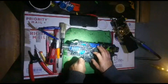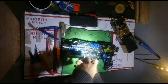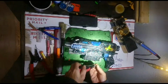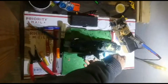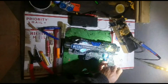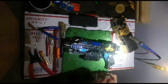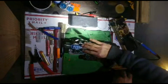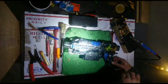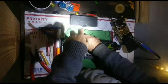So now we'll go ahead and put in all of the screws, being careful not to cross thread anything. And I'm only putting them in a few threads at a time, just so I can get good alignment on the entire body or shell. Because if you tighten one on one end, it might splay the holes from alignment on the other end. Thus, when you go to tighten down the other side, it will lead to stripped screw posts.